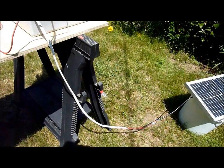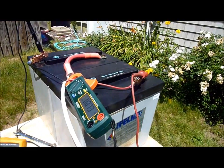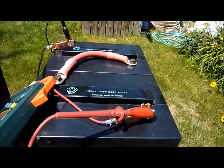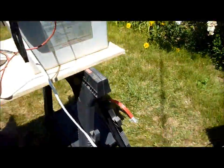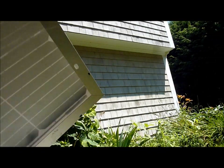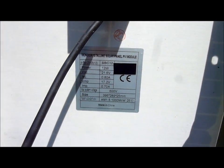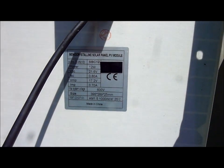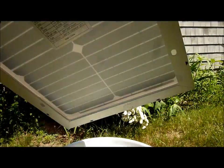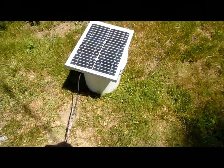As we can see, we can follow that line right from the panel directly up to this bank of Lifeline 6-volt batteries. These batteries are 220 amp hours — a pair of 6 volts wired in series for 12 volts. And we have down here a really inexpensive 12-watt panel that a customer basically gave me because the junction box got water in it. I kind of fixed it and am using it for this experiment. It's an ultra-cheap eBay panel, but it's a 12-watt panel.